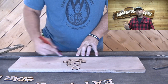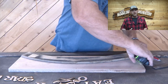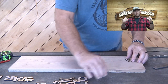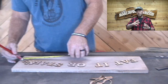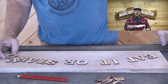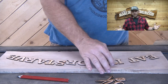The first thing we had to do is the layout. We're doing an arch on this, which can be kind of a pain — they're a little bit difficult to figure out — but the pre-made arch template really makes it easy. You want to measure from the top down on each side so you make sure your arch is square and not tilted. When you put your lettering on the arch, make sure it's even all the way across, with even spaces between the lettering and between the words. Once you've got it all set up where you want it, you just spray it.